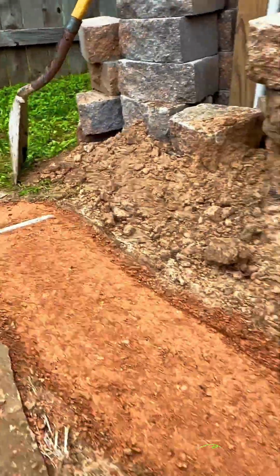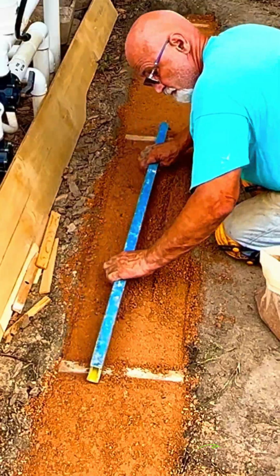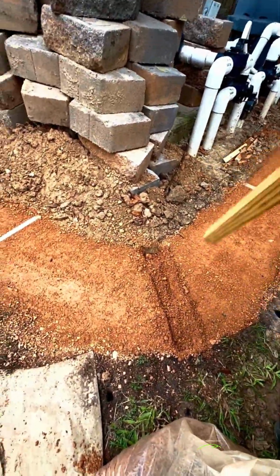I installed the granite in layers of 2 inches and compacted each layer. Once I was above the 2x4s a little bit after compacting, I screeded the entire foundation. Once the entire base area was flat, I put a screw into the 2x4s and pulled them out with my hammer claw, filled the voids, and compacted and flattened the patched spots.